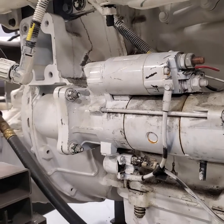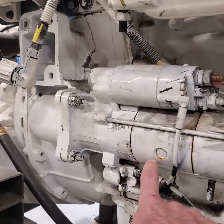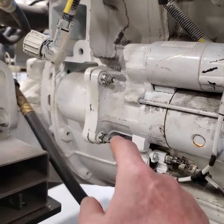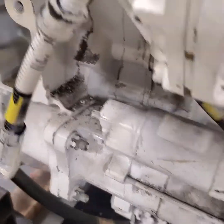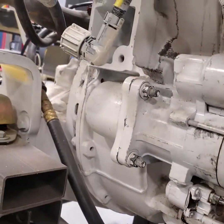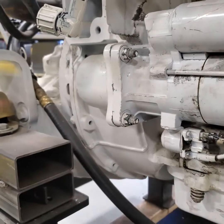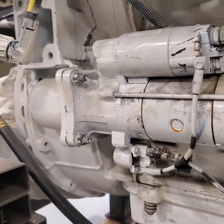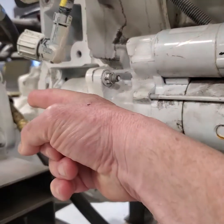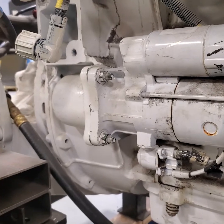In this application, because this engine comes from the truck industry, they have you remove the starter. There are four bolts that hold the starter in, and once the starter is out of position, there is a plate that goes over that. That plate gives you the ability to insert a cranking tool into the flywheel, which you could ratchet with a half inch ratchet.